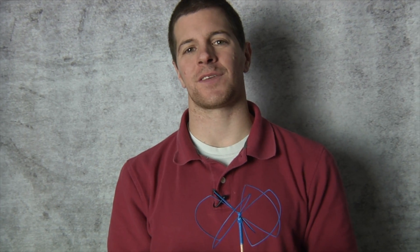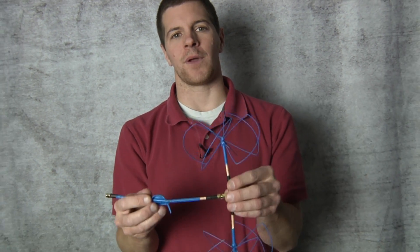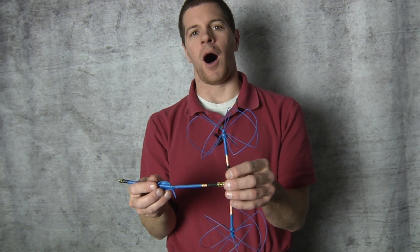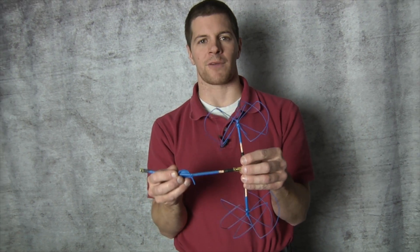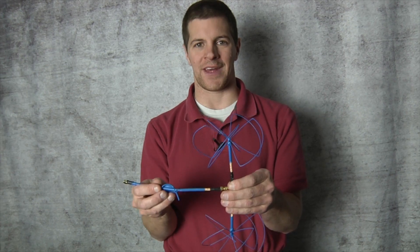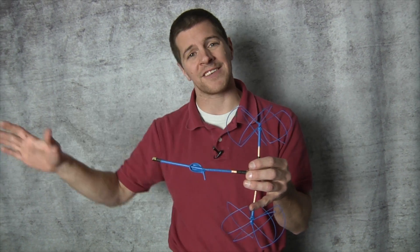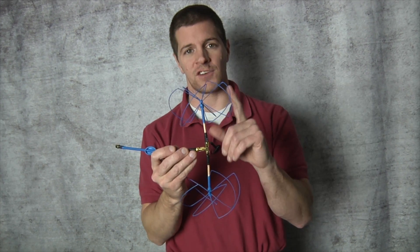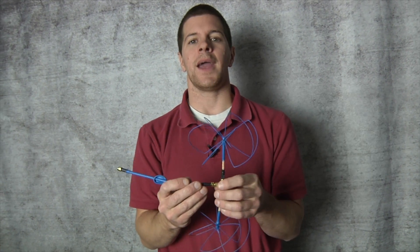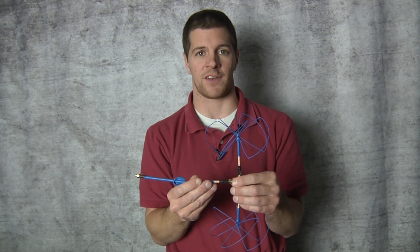Hi, I'm Alex Greve aka iBeCrazy with Video Aerial Systems, and today I'm going to bring you the SkyHammer. The SkyHammer is a 4.5 dBic omnidirectional circularly polarized antenna with very high axial ratio. That simply means it is higher gain, which means you can reach out about 60% further than just one antenna, and you also get a higher axial ratio so better ability to reject reflections.